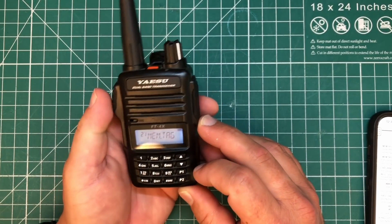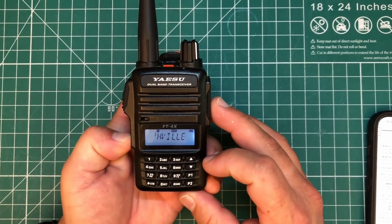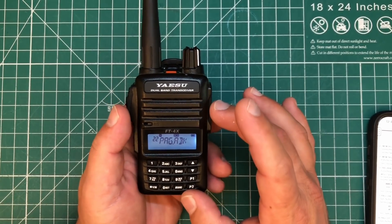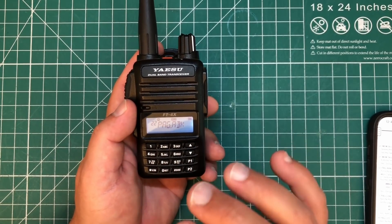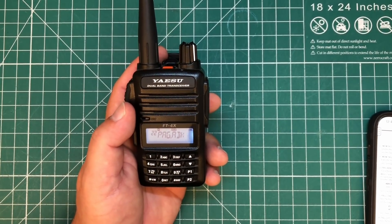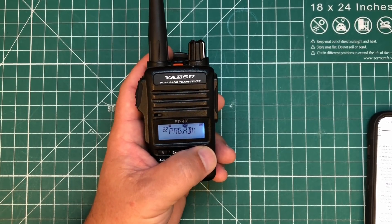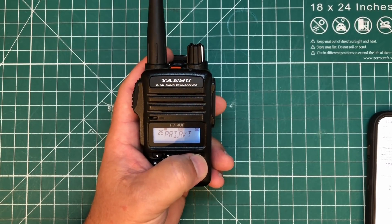You can actually tag your memory channels. So if I were in memory mode, notice how my channels have names — that's where you would go to name them, in the memory tag. Pager is a unique feature where, say you've got a bunch of radios all on the same frequency. Maybe you're in a group and you want to call just one person. You can actually set this up as a pager to only call that one individual versus having everyone hear your conversation. So that's kind of a unique feature — maybe you're out camping and you just want to talk to little Timmy and not let little Johnny know what you're talking about. The next few pages deal with setting up the paging function.